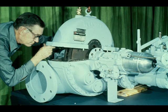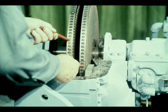To do so, we'll remove the case cover so you can see the rotor. Removing the upper half of the casing has exposed the rotor assembly. This particular turbine is equipped with two wheels, even though it is a single-stage machine. Both of these wheels are in the same stage, increasing the efficiency.